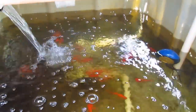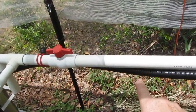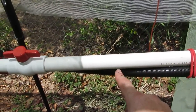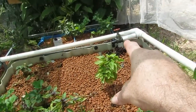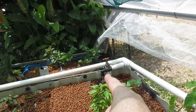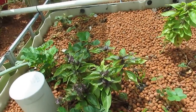The goldies are going all right — more than happy in there at the moment. The water's nice and clear in both tanks. We are getting a fair bit of sediment or solids build-up in the pipes. I'm going to have to put in some sort of a swirl filter or solids filter, probably in this line here, so as the water comes through it'll go through the filter and then off down to the bed. I had a couple of the taps nearly clogged the other day — the large taps and gate valves had a build-up of solids behind them, so they all needed a clean-out.